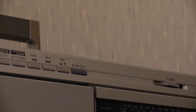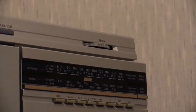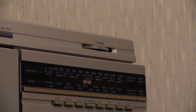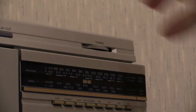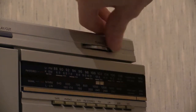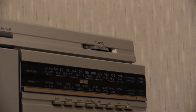That other control along here is a tuner — just down a bit, that's the tuning for the radio. Like a lot of my other boomboxes, you tune this one in with a piece of string. There's a pulley on that, and you can see that little indicator going along — when you turn that knob you're basically operating a piece of string that pulls that pointer backwards and forwards, and the other end interacts with something electronic to pull the tuning into the station you want.